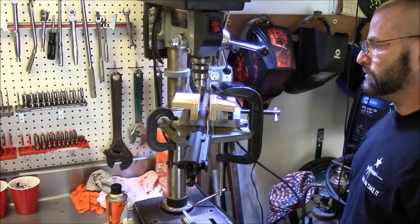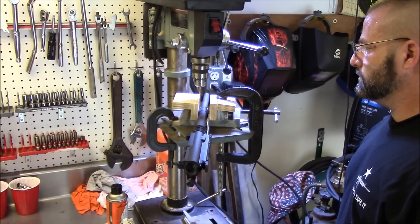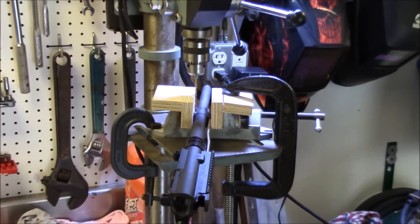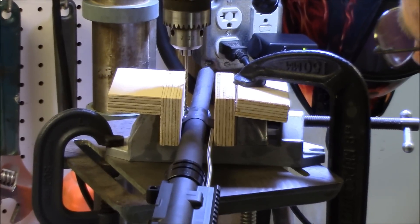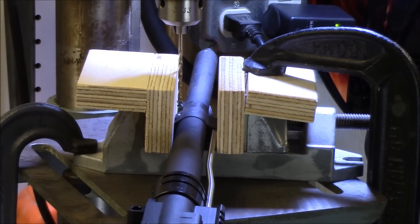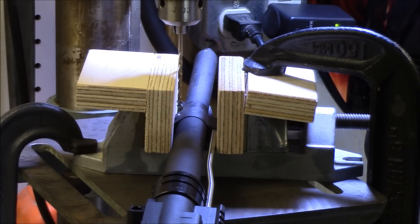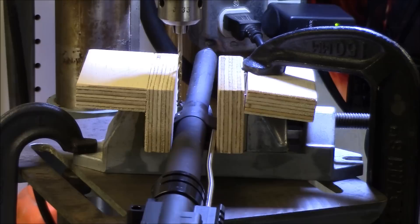Okay, we're back. Now we've got it set up in the drill press. It's called the gunsmith gas block but we've kind of done the backyard garage gas block here — I think we'll be alright though. We put the gas block and barrel in the drill press vise and clamped it all down, making sure everything's level. The barrel's level to the drill press table and the table's level. Now we're going to fire it up, put some cutting oil on, and just drill nice and slow.